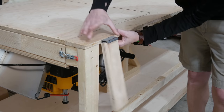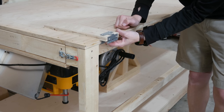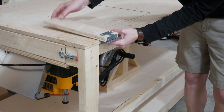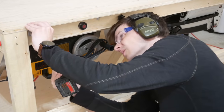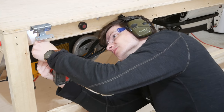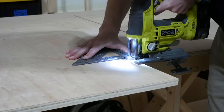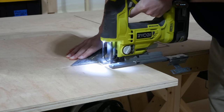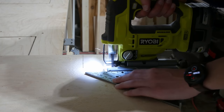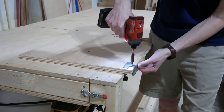I'm using what is called a five-knuckle hinge to make this work. These hinges are specifically made for three-quarter inch material and allow for 270 degrees of rotation, which is what we need to allow a tool to be stored under the table and then flip up to the top of the bench where we can use it. I mounted two hinges to the underside of the plywood overhang for the first flip-up panel. The hinges extend pretty deep under the plywood, and this is why we needed the spacer between the legs and the frame of the workbench earlier. I cut six pieces of three-quarter inch plywood for the flip-up panels on the table saw, then cut out access holes using my jigsaw on the four panels at the ends so we have a way to reach the retaining knobs of the rotating tops. Then I flipped the top into position and screwed the hinges to it.